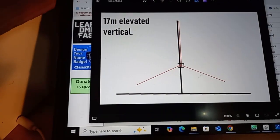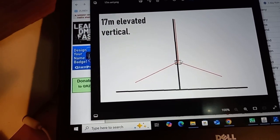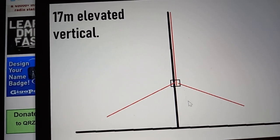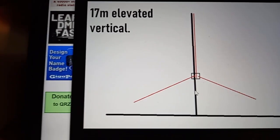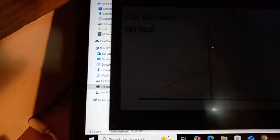This is the basic antenna here. It's about two metres off the ground and we have two radials and a radiating vertical element going straight up at the top. This can be fixed to a pole or hung from a tree. This is actually my 20 metre one but it's a similar situation — just a basic pole fastened to a tree. You can fasten it to a fence or in the corner of a garden and put the radials on top of the fence. They don't have to be spread across the ground or in anybody's way.